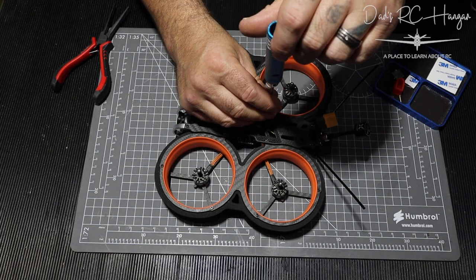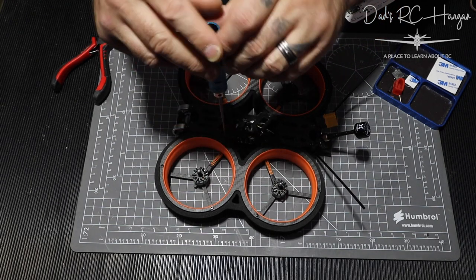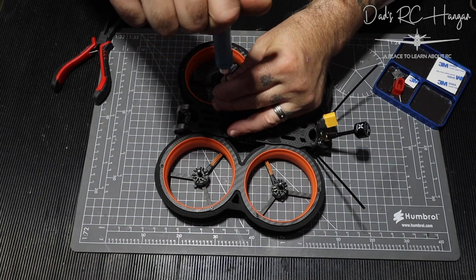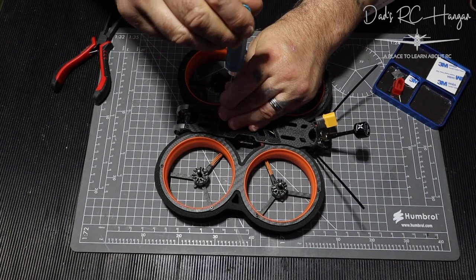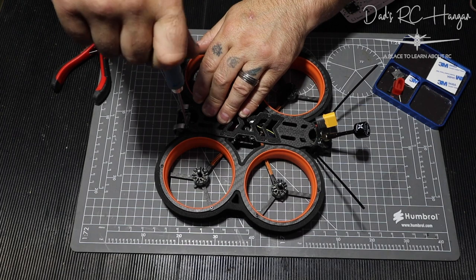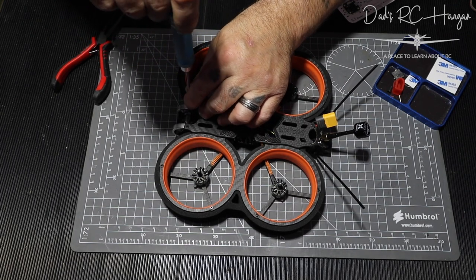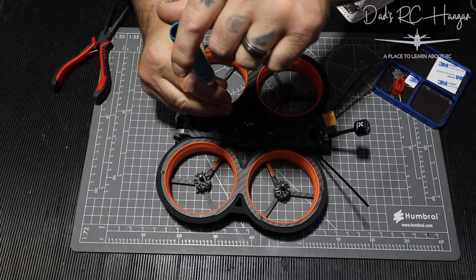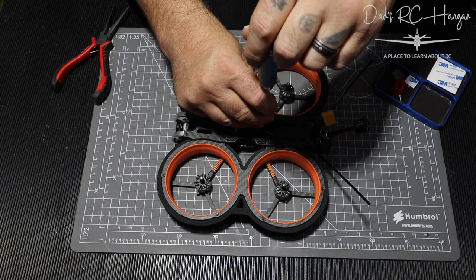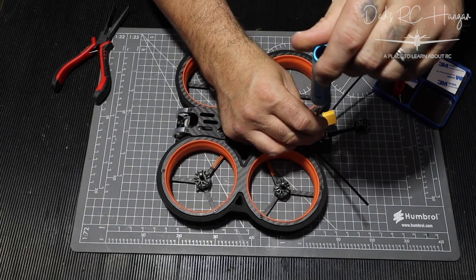Basically, what it's to do with is that when you rev your motors up on Betaflight, it's not in flight mode, in newbie terms. It's not thinking, right, I've got to take off in a minute, I'd better make sure that I'm level, and I'd better make sure that I'm listening to the receiver. The flight controller is listening to the receiver, isn't it? So I was correct, really. What it's doing is just revving up the motors. Yeah, number one working, number two, three, four. Unless you've got an octocopter, then you've got eight.